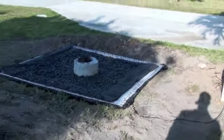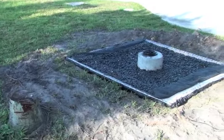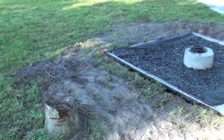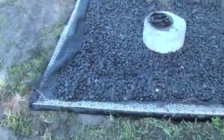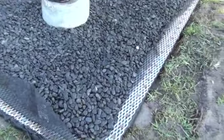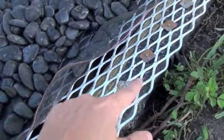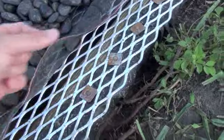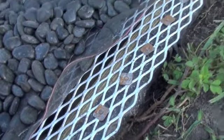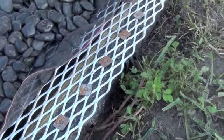It's Friday morning. We started this project Monday night — well, we built the base Saturday but started digging out here Monday night. As you can see, we've cleared a bit of the dirt and moved it over here. What we've done is put 2x4s basically all along here, rolled the tarp under and over the 2x4, and then used these roofing nails — which have already gotten surface rust overnight — to secure the metal and plastic to the wood.